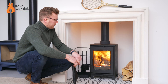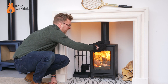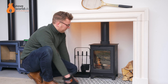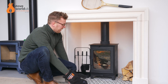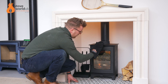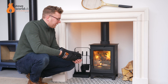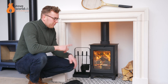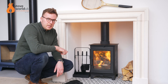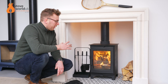So let's have a look and close the stove down. We'll close the top one to begin with — you can see a dramatic effect already. And then the bottom one completely kills the stove off. Now it's worth noting that this model has got the DEFRA restrictor removed, because we're not in a smoke-free zone and haven't got a five-inch system, so we've actually removed it on this one.